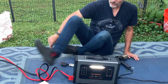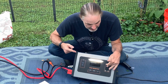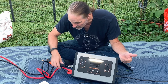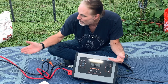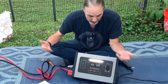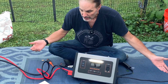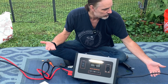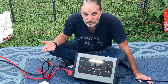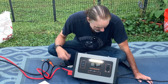I'll put a link in the description below. I encourage you to take a look at it and entertain the idea if you need something small to power a device in an off-grid situation — this is the beast. It's simple. You don't have to hook up a whole bunch of stuff. You can store the batteries pretty much anywhere you want, plug this in, and voila, you've got off-grid power. You can plug it in once a month and charge your batteries with an extension cord. It runs at 1000 watts on AC charging, so it's running at just under 10 amps — you can run it off a standard wall plug. It's just a fantastic device and I don't really have anything bad to say about it.